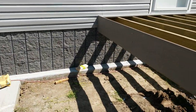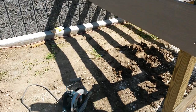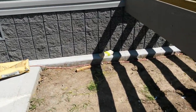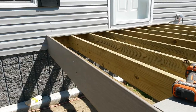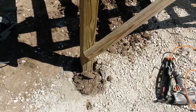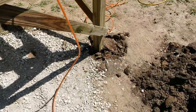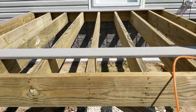Here we've got the composite deck we're putting on a mobile home - it's an 8x8. I got the skirt board on because I need to figure out my stair stringers. It's on a slab, so I bolted it into some good meat inside the trailer to hold it up. I put this post in concrete with a good pile of rock underneath so any water will drain away from the post and won't rot it out. Got these ready for sleeves because it's going to get vinyl railing.